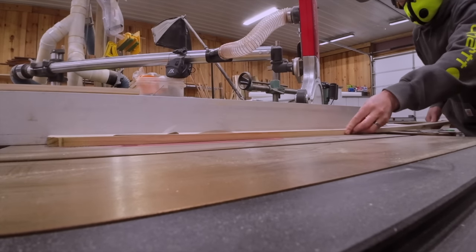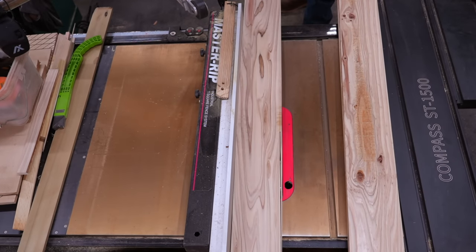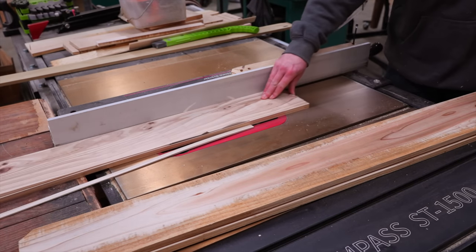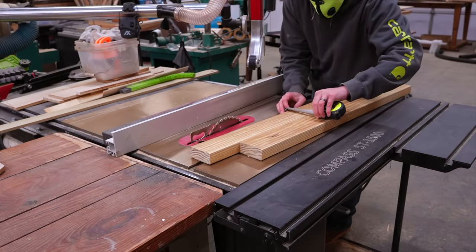This is a very large, impressive planter — it's almost like five planters in one. So it's going to need a little bit more material than we usually use. We're going to need nine fence pickets total as well as two two-by-fours. Now I'm just ripping all of my fence picket material down to size, and for my two-by-fours I'll rip all of those down to three inches.